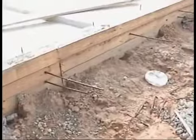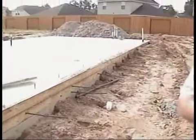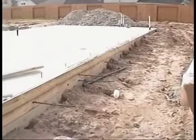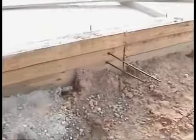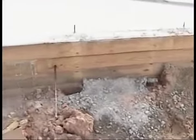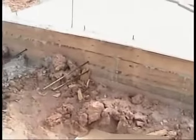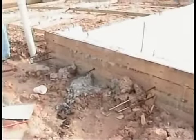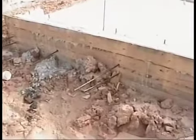I'm often asked why slab construction is not used up north. Why don't they build with walls and piers? Why don't they use slabs up north? Well, the reason is the ground freezes in the winter, and this freezing can shift the slab at worst and at least lead to cold floors in the winter. It's also a reason why most homes up north have asphalt rather than concrete driveways. You get that frost heave, you're going to have a lot of cracks in the driveway as well as your slab. Once again, the slab on grade like we have here is traditionally used in the south. It would not work up north.